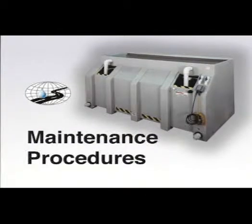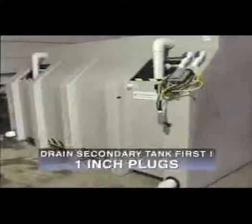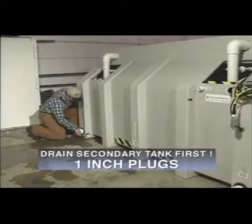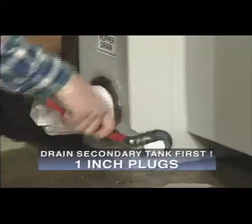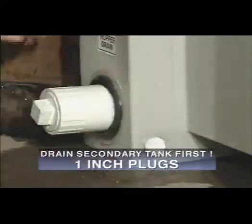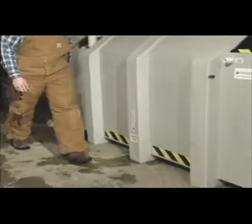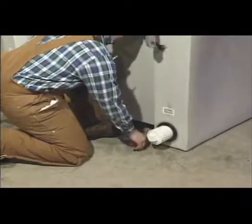At the end of each season, it is necessary to perform a major cleaning and system flush. Do not allow the system to remain full of salt and brine. Keeping the system clean will provide an easier start-up the following season. You must drain the secondary tank first to avoid hydrostatic buoyancy. If there is liquid in the secondary tank and none in the main brine tank or hopper, these two inner tanks will act like a bobber and can lift upward, creating excessive force that will literally tear apart the tanks and piping.